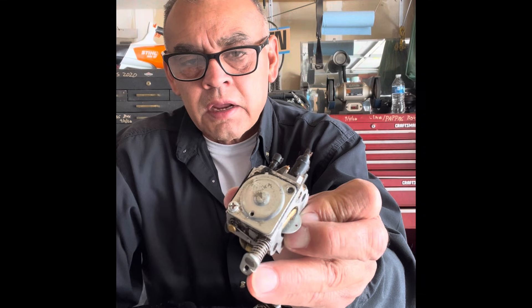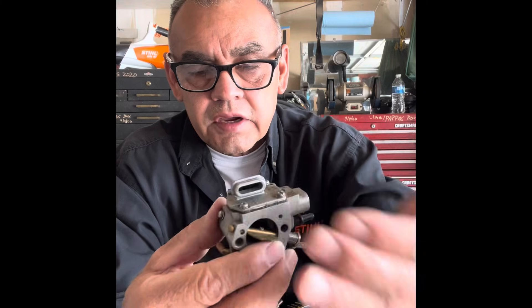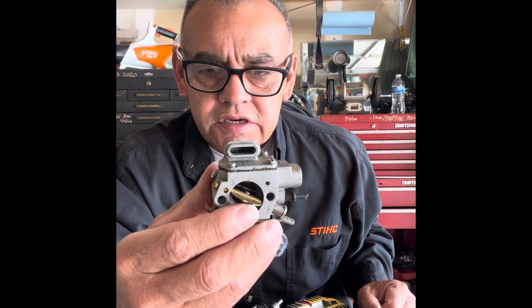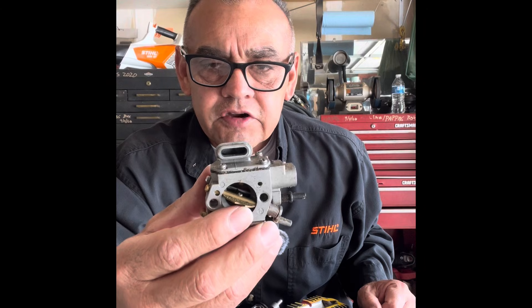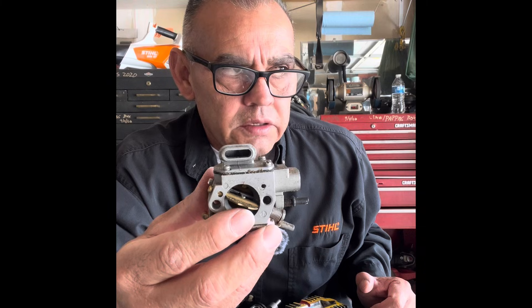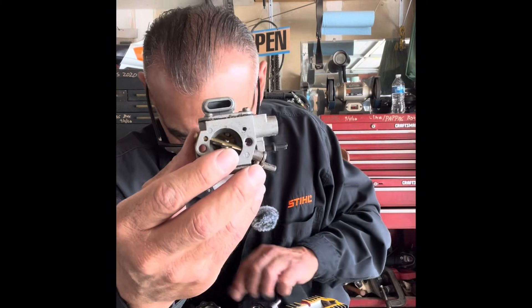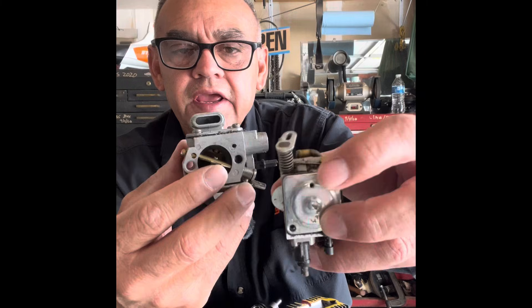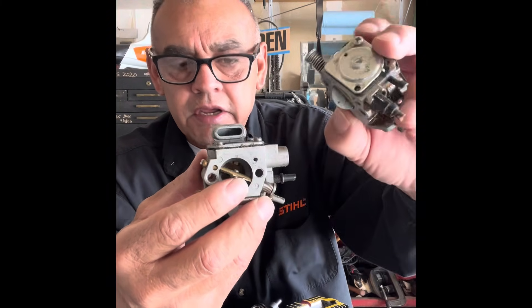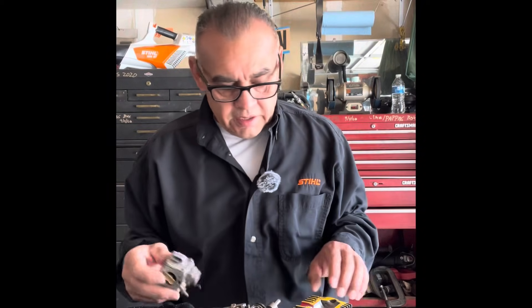That hole makes your diaphragm pulsate. This one still has to pulsate, but it's connected into the actual air filter. It's called the Intelli carburetor — the intelligent carburetor — where my filter can be up to 90% plugged up, filled with sawdust and debris, and you won't lose any RPMs. With the old style, a piece of debris or a leaf gets in that hole, you lose atmospheric pressure and you're gonna get that bog-down sound.